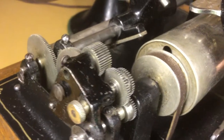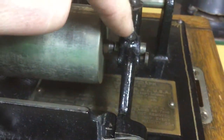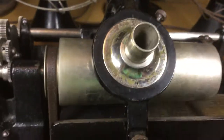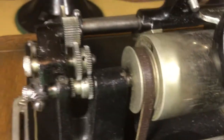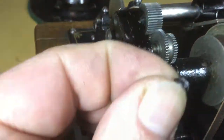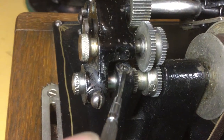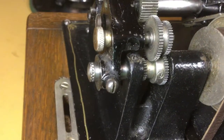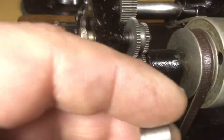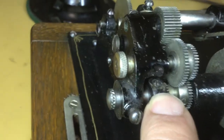The first thing you will have to do when installing the two and four minute gearing is to loosen up the set screw and tension screw on the end gate cup bearing for the mandrel, because you will have to shift the mandrel over. Then on this side you will remove the stub bolt headed set screw which goes right here for the drive end cup bearing, and the tension screw which goes on this end, and the cup bearing itself.